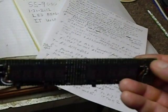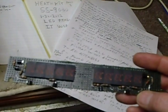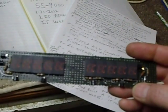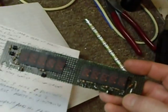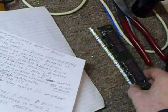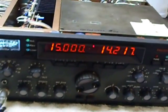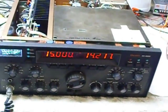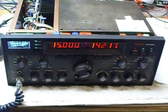So I started constructing my own digital readout. This first prototype board has very cheap, small generic LED digits — one of them failed before I even got it built. I found they were current hogs, needing 20mA just to see them. I scrapped it, cut a slightly wider piece of perf board, and put better digits in there, which you can see now.